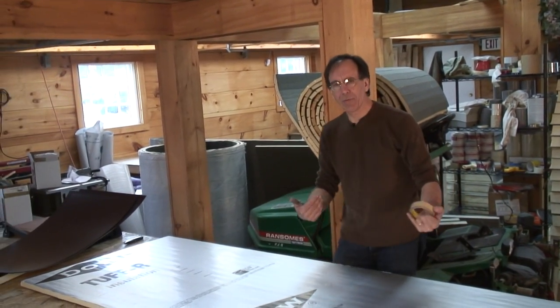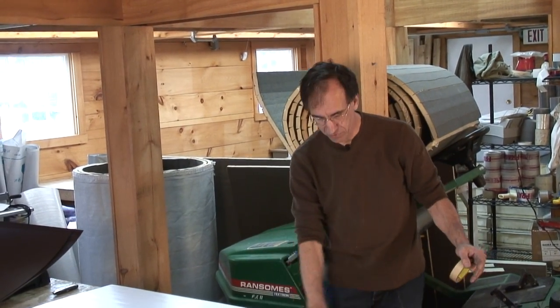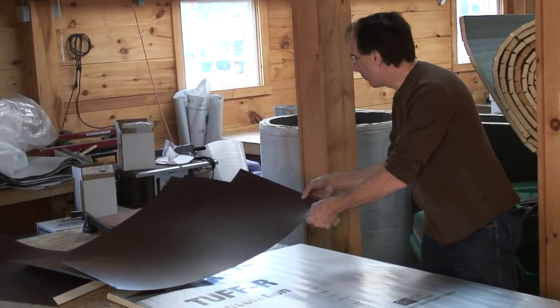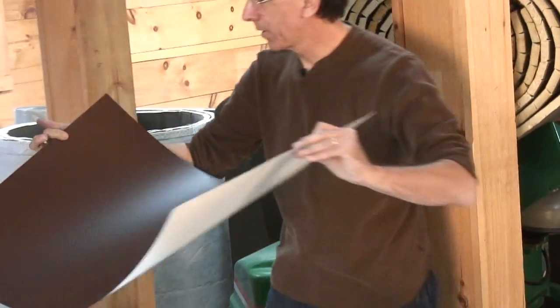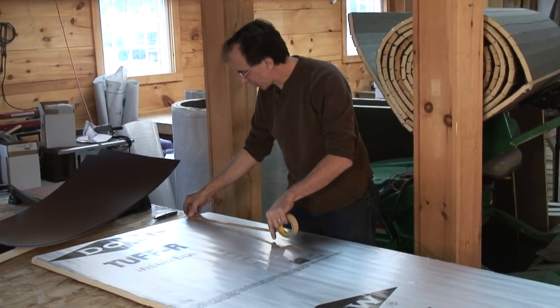So the backside of the collector, for many years I actually put the foil to the outside and let that be the weathering surface. Usually it was down against the roof, so it was never an issue. This particular array is going to be exposed. The collectors will be vertical. So we need to cover it, and we have some 2-foot wide aluminum trim that siding guys use. I got that at the local lumber yard, and we're going to stick that to the back.